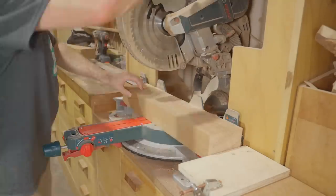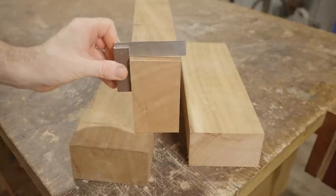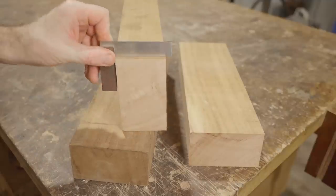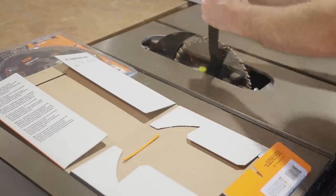A few years ago I bought a pile of different timbers and this maple was in there. It's already been dressed but I think somebody's jointer fence must have been a little bit out of square. I'll change the blade in my table saw and square those up. I've been trying out these CMT blades and the one that's in is more suited for cross-cutting.